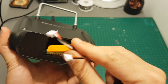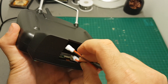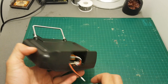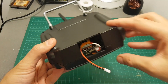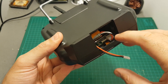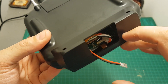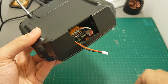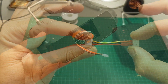You will have to provide your own battery — it's not very convenient. You insert the battery inside and then use the balance connector to turn it on. I highly recommend using an extender to protect this connector, because it will make your life much easier. With some batteries I found myself struggling to insert them, and I think this connector is not very durable and can fall off. If you want to avoid opening the remote controller and re-soldering the connector to the board, get yourself a 2S balance connector and make an extender.